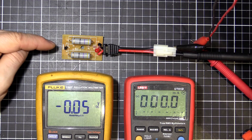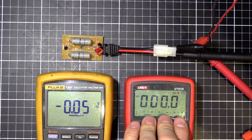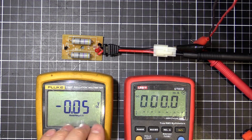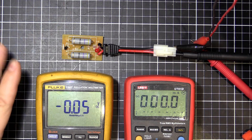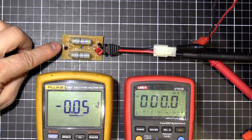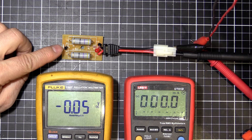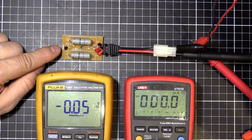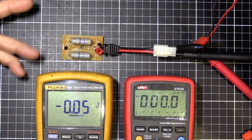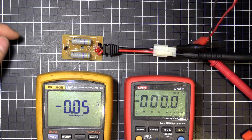We're plugged in here with our battery conditioner into our power supply. We've got the Fluke here on volts and the Unity on milliamps — that's the current we're pulling through the system and that's our simulated battery voltage. If you watch the LED, you'll see it turning on and off as we hit around about 5.6 volts. The transistor is a High Sincerity Microelectronics HE8050S — a 20 volt, 700 milliamp NPN transistor, just a standard general purpose transistor. Let's crank this thing up.